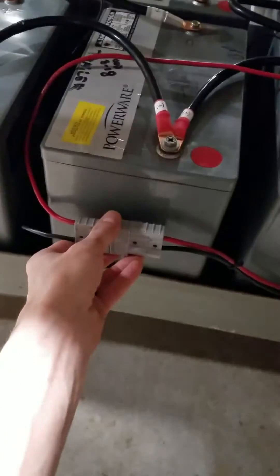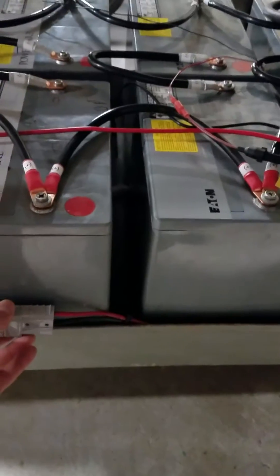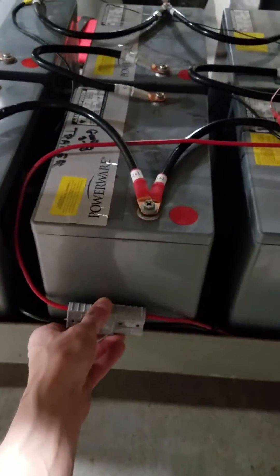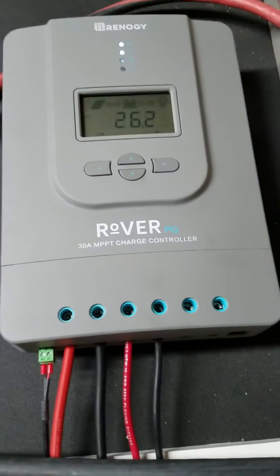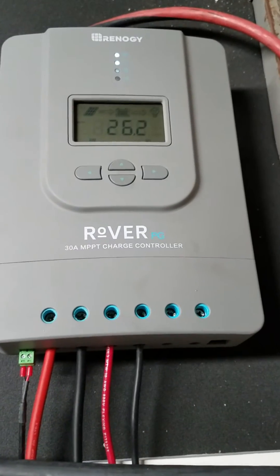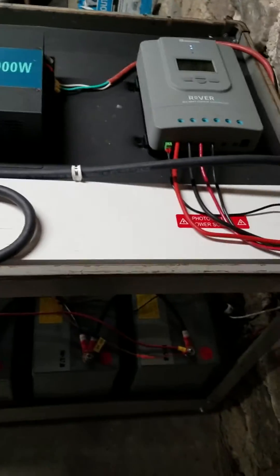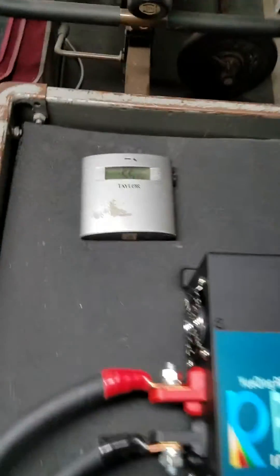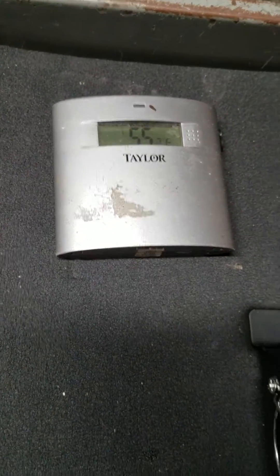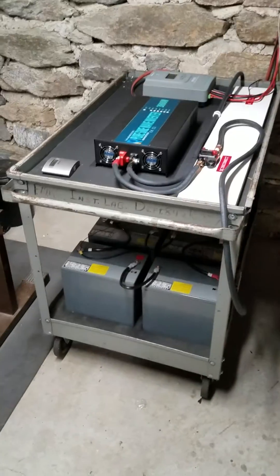Here's my plug-in for the solar panels that I have charging them all the time. It's just two 100 watt solar panels that are in series at 24 volts. It'll see upwards of 40 volts usually, and then it steps it down to around 24. Other than that, they stay nice and cool down here — it's 55 degrees right now in the middle of December.